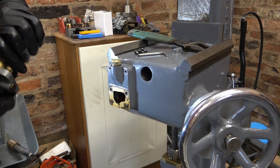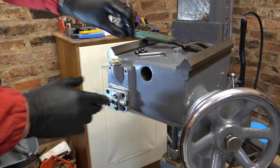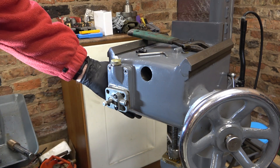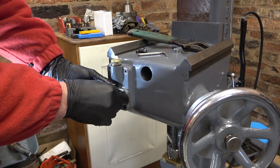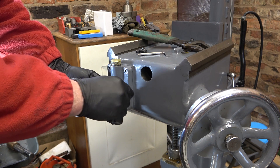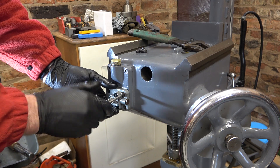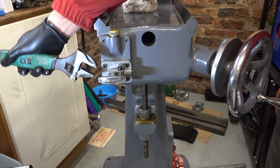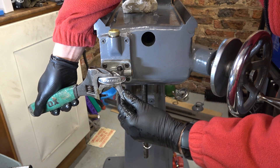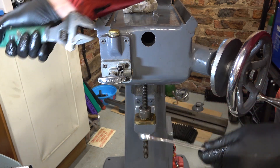Okay, with new seals fitted — there is a possibility there's a pinhole in the casting because the oil reservoir is just this body of the knee, but I think this was the cause of the leak. It certainly was leaking; I'm just saying it might not be the only leak. Well, that job didn't amount to much but it might save somebody else some time. That seal was so hard.